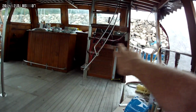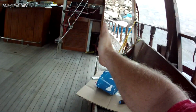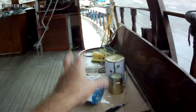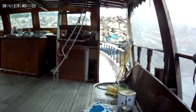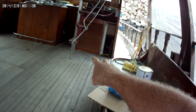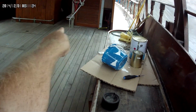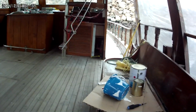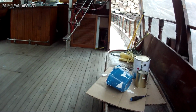Now what I'm going to do is have 1 inch on the side, 1.5 inches at the top, and 1.5 inches on the other side. Then I put in the teak ply, and below that I've got my shelf for the hose and the torch and some other stuff, which I'll access from this side. On the bottom I'll put in 2 stainless steel pins with 2 receivers in the floor, and I'll scribe the bottom to the curve of the deck so it just sits there. At the top it'll have 2 latches where you press it in a little bit and then it comes out, and you lift the whole thing up and out, so you have total access to my charge controllers and dump loads and so on.